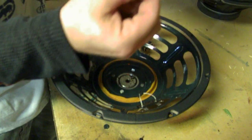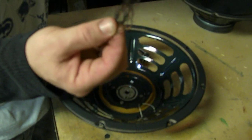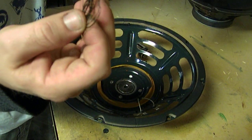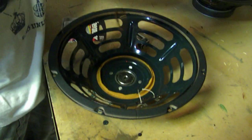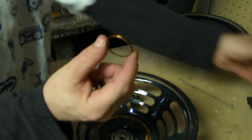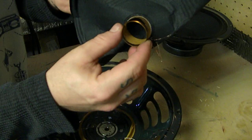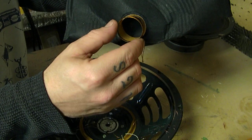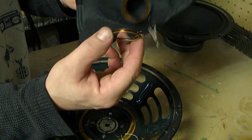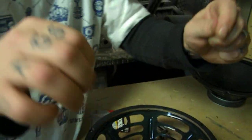You can see the copper is blackened and it's totally melted and come completely apart. There's what we're looking for — the winding of the voice coil. We completely burnt this thing in half; we got the voice coil winding so hot it burnt itself in half. And there's the rest of your voice coil from our experiment.